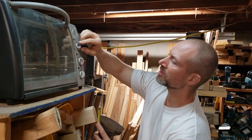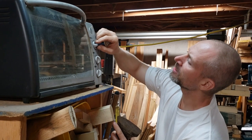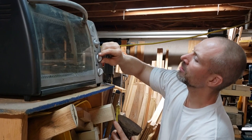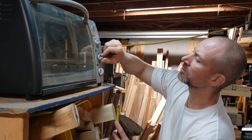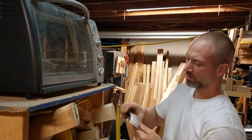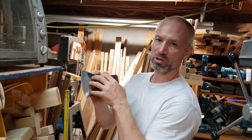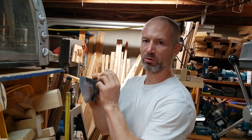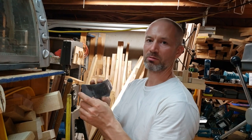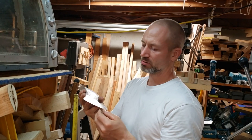This is my super fancy and high-tech tempering oven. And I'm going to turn, these aren't very accurate, I'm going to turn that to a little above 450. Right now I'm just going to bring it up to temperature. What I want to see when this axe comes out of there is a kind of purplish color with a little bit of yellow, a little bit of blue. It's called peacock. Maybe more toward the blue, because it's too hard now. I'd rather it be a little on the soft side than too hard.